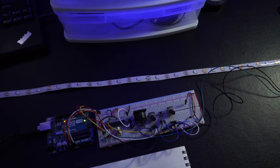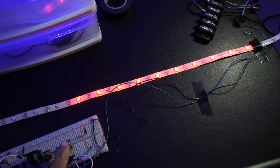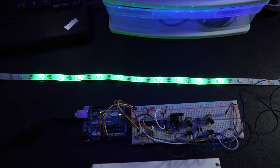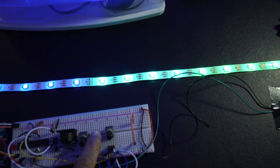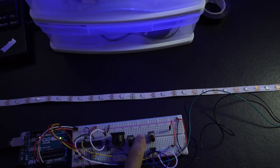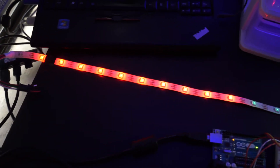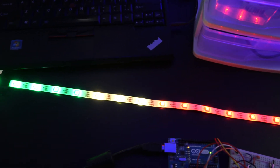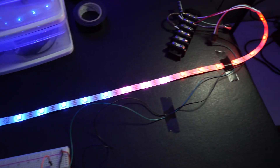Here I've set up a clearer example of RGB addition in action. When I press a button, it displays a 10-LED-wide bar of a single color — either 100% red, 100% green, or 100% blue — with a very slow fade out so we can see what happens when they combine. Blue and green combine in the middle to produce a teal color until they fade out. Green and red combine to make yellow in the middle. As you can see, RGB addition can lead to some pretty cool patterns. I prefer it over the distinct colors of the previous method, though I guess each will have its place.